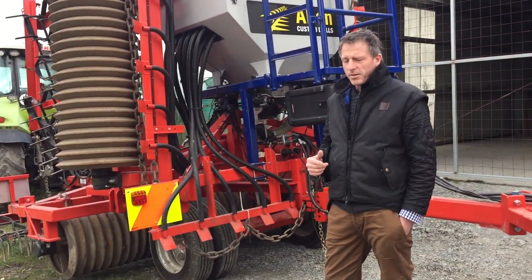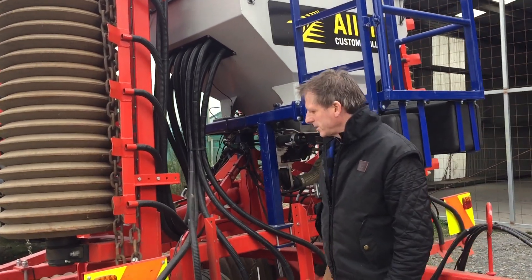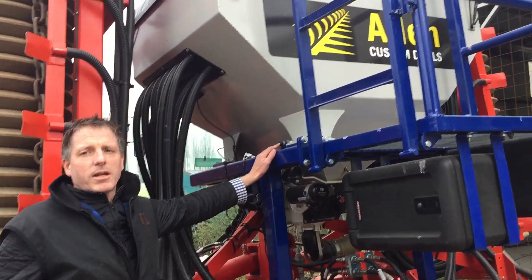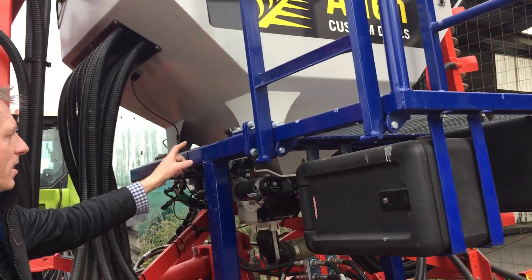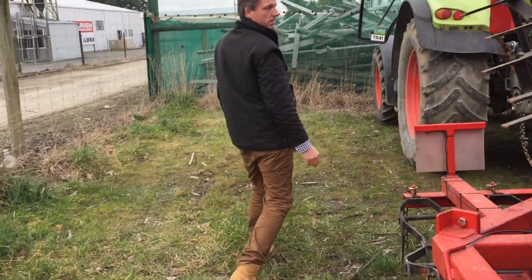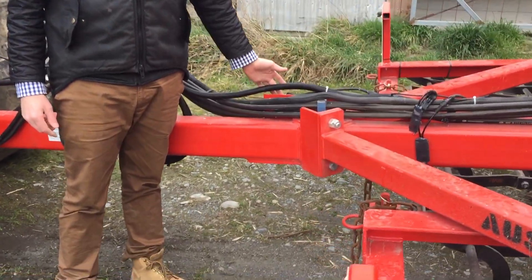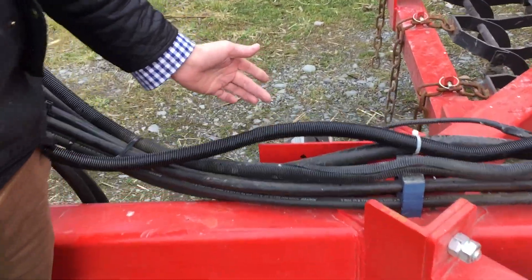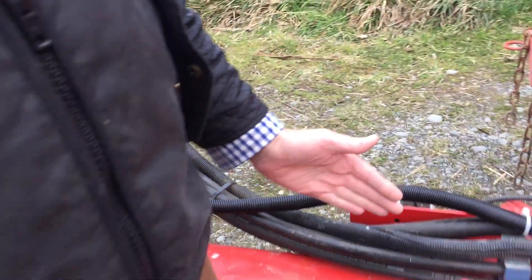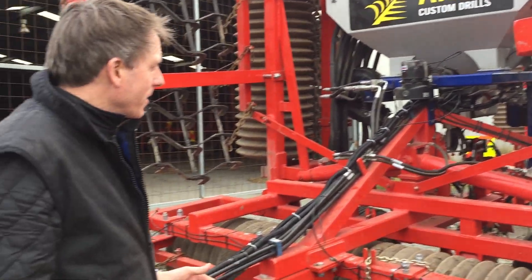Just explaining the gear on it. The C-bin has the electric motor running the metering unit. Just here we've got a calibration switch, so when we calibrate this thing it's easy to make everything happen. On this drill we're running a radar, but we could run off a GPS speed pulse or a ground wheel sensor. All we do is run a loom down the drill — no magic boxes full of electronics. All the smart stuff happens in the cab, keeping the electronics secure and in good nick.